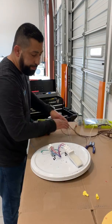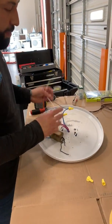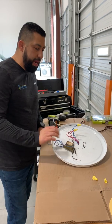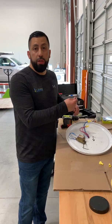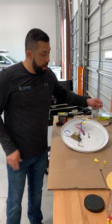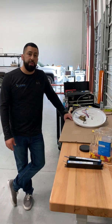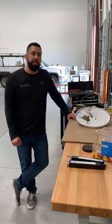I'm going to turn off the power again. Once I'm done, you can button the fixture back up and you're good to go. All we're doing in this case is eliminating the ballast, bypassing the ballast, and direct wiring it — line voltage, 120 volts coming in from the junction box. I hope this information has helped. If you need further instructions or have any more questions, please send me an email and I'll do my best to walk your maintenance team through the steps.